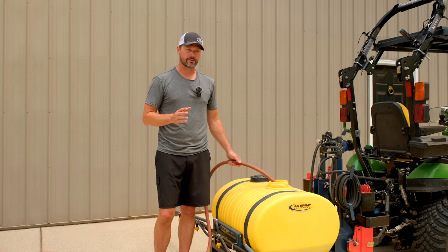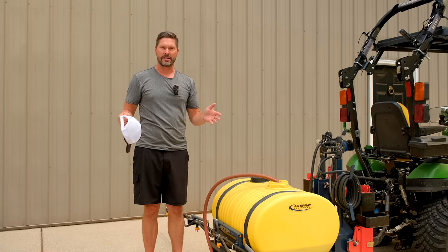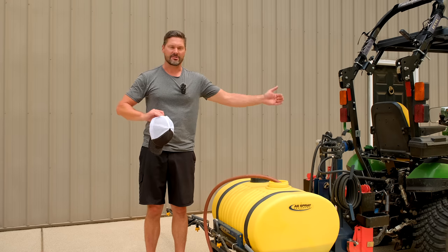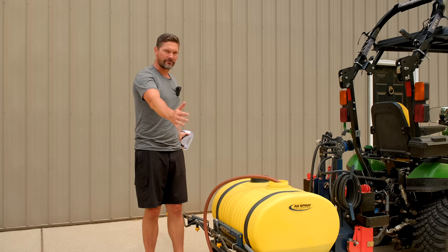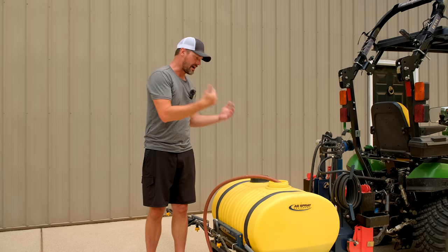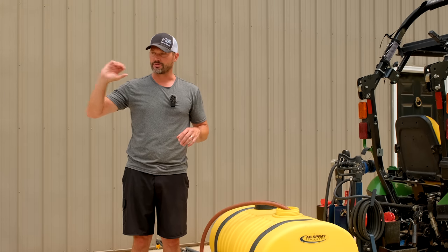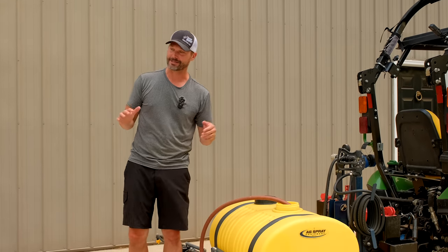As far as timing quantities and speed — this tractor doesn't tell you your speed, so you can do some tests. Drive along maybe 100 feet, see how long it takes at full throttle in low range, then multiply your coverage by length and do your acreage calculations. That helps you determine how long it'll take and how much product you need. Honestly I don't get that scientific with it — I know I've got approximately two acres in my yard, that requires two jugs of weed and feed, so I kind of eyeball it and it comes out pretty darn close.